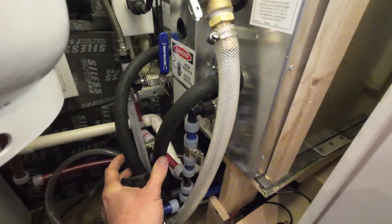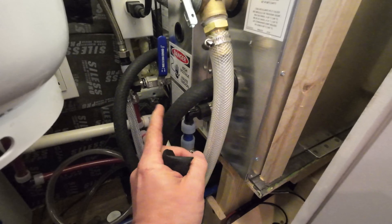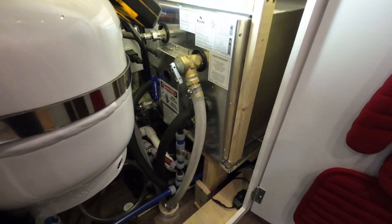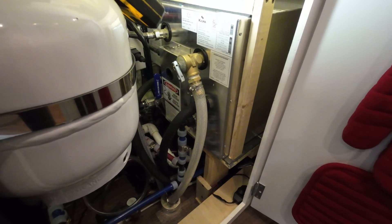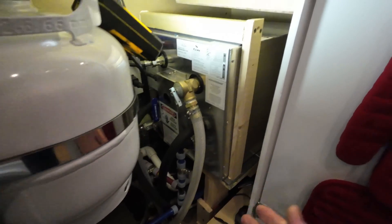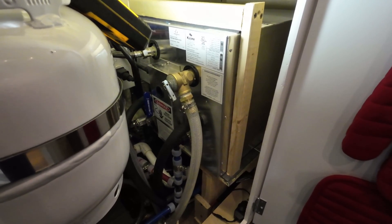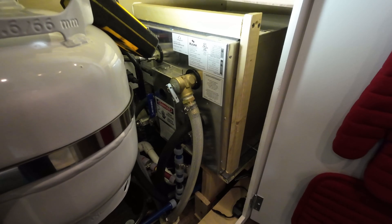You can see I've got two five-eighths-inch heater hoses that run from the front, making a coolant loop with the factory engine coolant. I did a whole video on how I installed one of these in my Promaster van conversion — there'll be a link in the description. Now, some other brands that heat water similarly with engine coolant have a thermostatic bypass valve installed between the hot and cold water inlet and outlet to keep the water from getting too hot. I never had that problem with my first one.